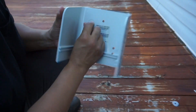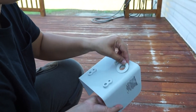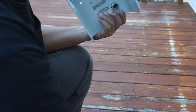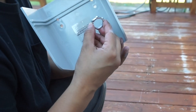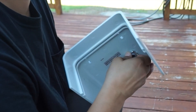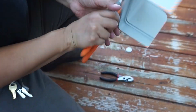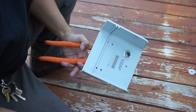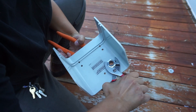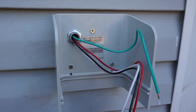This here is the outside unit. You have to pop out that little circle — a little washer comes out and you put it on the back, then you put the little plug where the PVC pipe is going to be cemented in with all-purpose cement. I'm tightening it up now — not too much, because there's going to be cement on there and also an o-ring that'll weatherproof it.